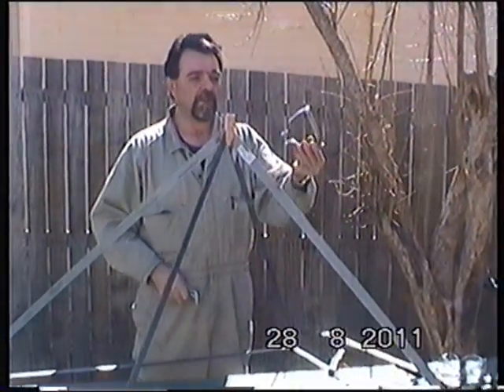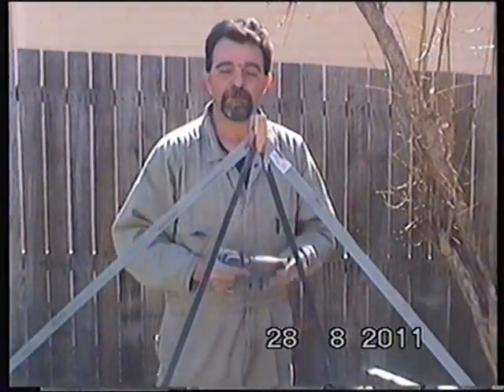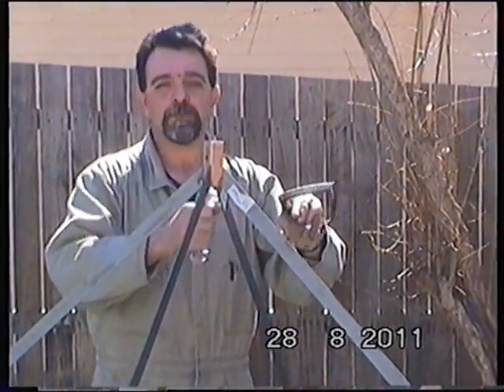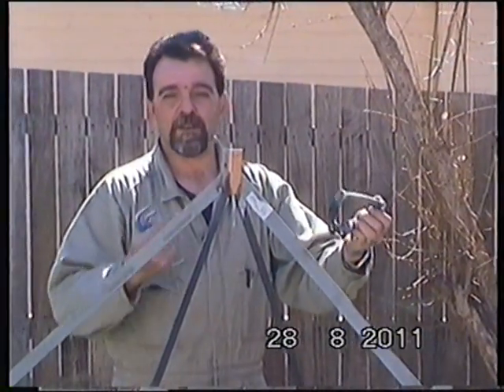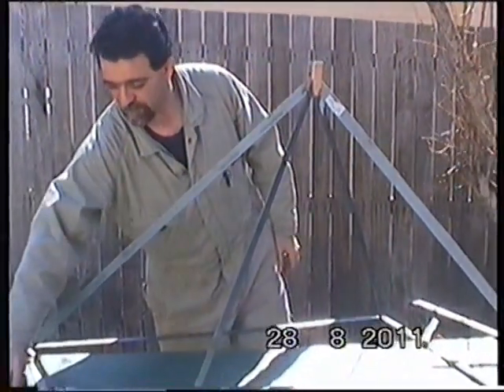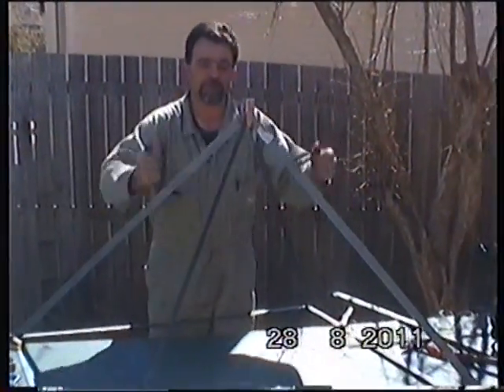I made these handles just by hammering off-cuts from my flat bar - too easy. A piece of pipe in the middle, using the hammer and the vice clamp on my bench. So all that being said, they'll be ready to mount after I drill the holes.